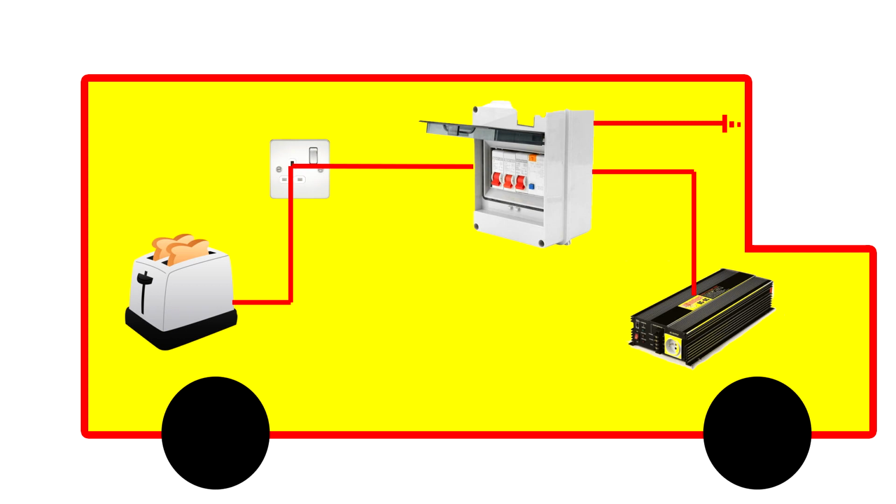The vehicle chassis is live, and you could be the person that would ground it, thus get an electrocution. Secondly, the components in your vehicle are probably not going to be 240 volts. They're probably going to be either 24 volts or 12 volts. Now you're putting 240 volts through your 12 volt component, which, to anyone that's ever troubleshooted vehicle faults, is bad. We could blow sensors, we could blow modules, relays, all sorts of problems by overvolting components that are rated for a lesser voltage.